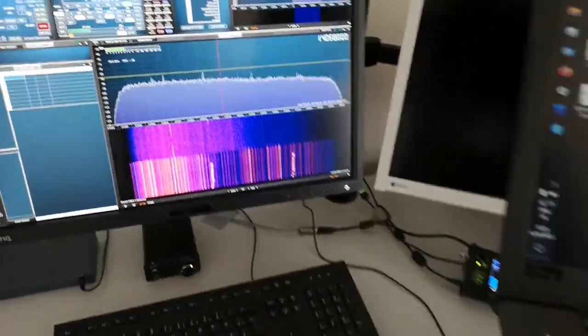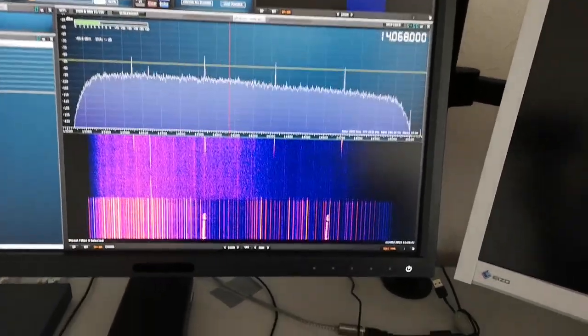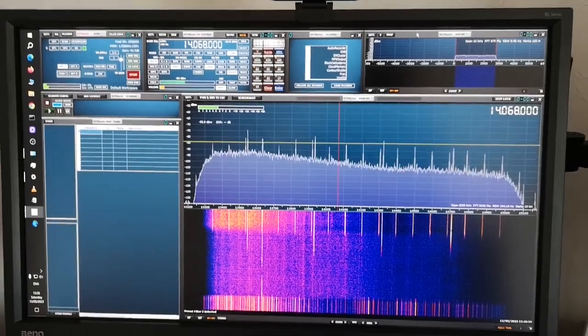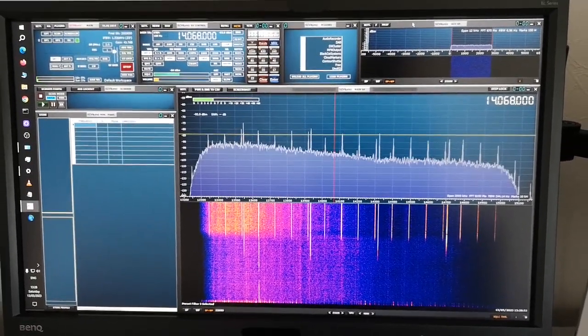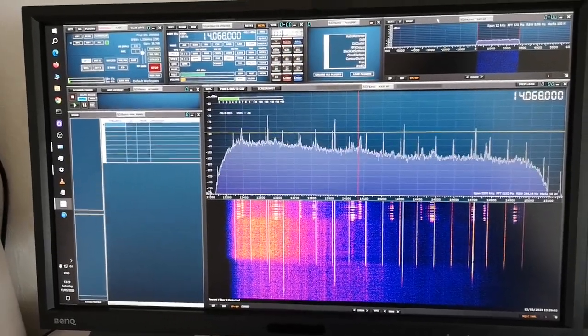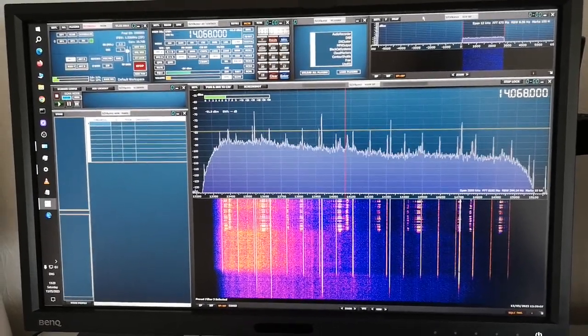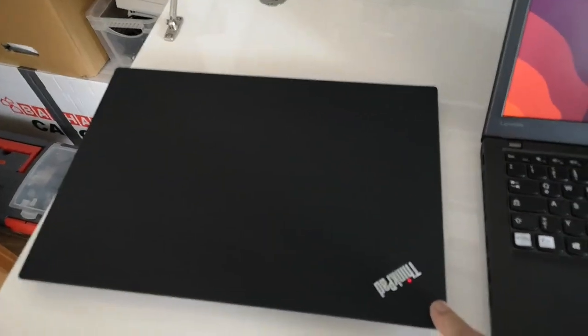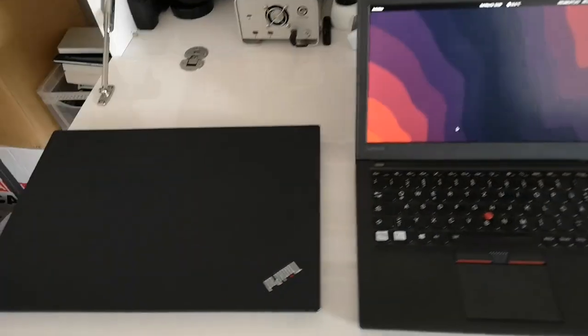The last one is this plastic V130 from Lenovo. Let's put that near the antenna loop and see what happens. When I place this laptop here, you see some spikes in the spectrum again — spaced further apart, probably due to the lower clock frequency or something like that. There are plenty of them. If I touch the trackpad, those spurious signals appear — they're a bit more like noise than pure carriers, but they are quite nasty. So the quietest laptop from that experiment using this apparently more sensitive receiver is the X260. I've done similar things with the big T570, and that is also as quiet. So these are the quietest two, and these are the ones I'm going to use for further experimentation.